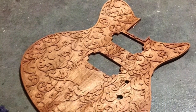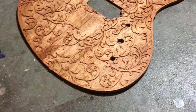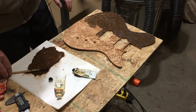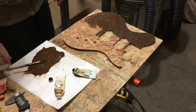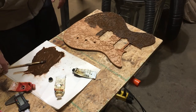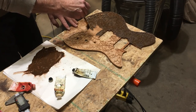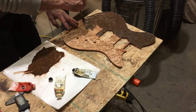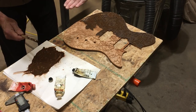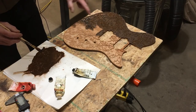This is how the design looks after I finished engraving it with my X-Carve. The next step is to apply some finish to really make the design pop. I'm going to enhance the look by applying artist oil paints — I've mixed up some brown, black, and red, then added a little paint thinner to make it more watery so it gets down into the deep engraved areas. Then I'll go back with a rag dampened with mineral spirits and wipe it across the top surface to take it off the high spots and leave it in the low areas.